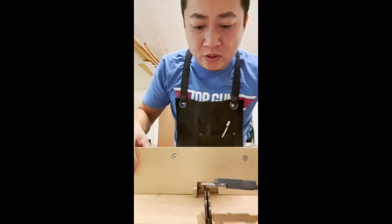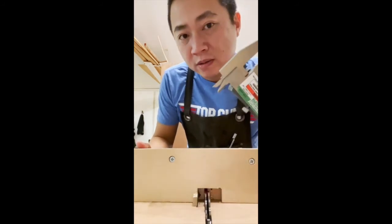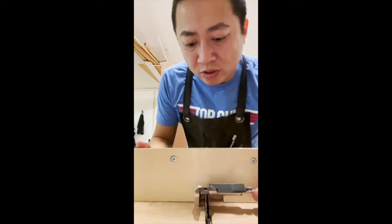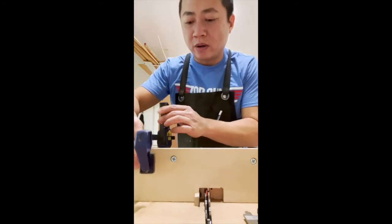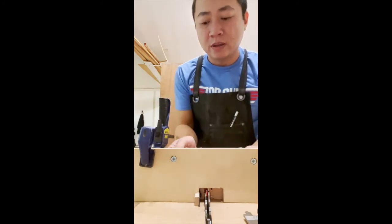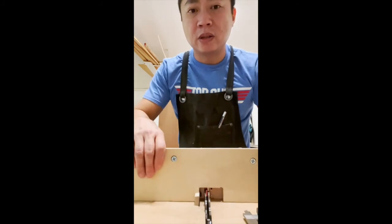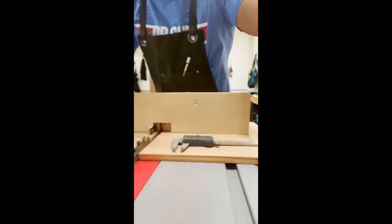What I'll do is I just want that same spacing between my metal pin and the blade itself. So I'm just going to touch one jaw against the tooth of the blade, and then just slide my jig so that the metal portion touches the other jaw. This should be three-eighths right here. I'm going to secure it with a vise, then lock it in place, take off my quick grip, and I can see that I can't really move anything at all. It's nice and tight and secure, and everything else to the jig is the same — there are these rises against these miter slots right here.